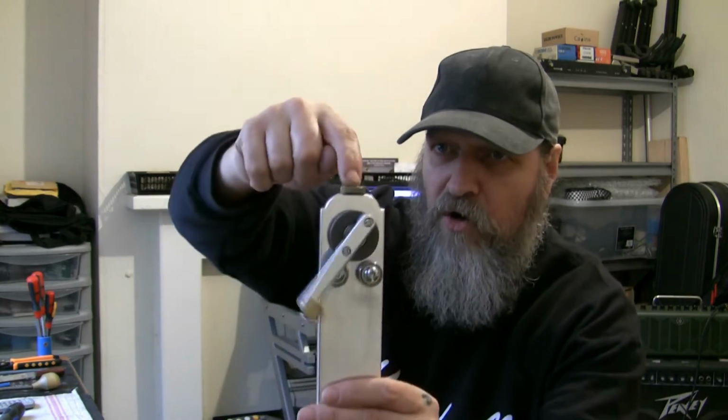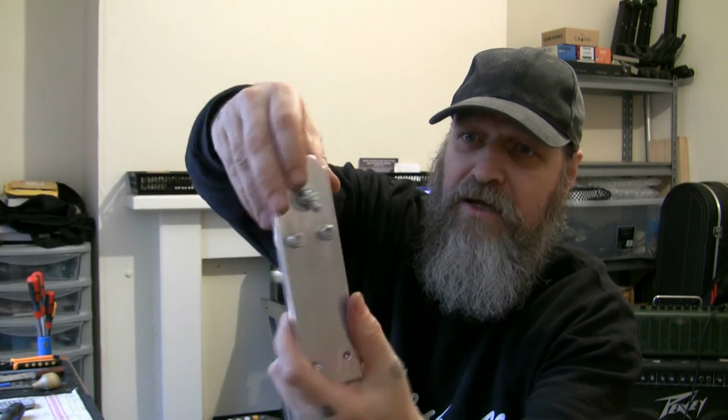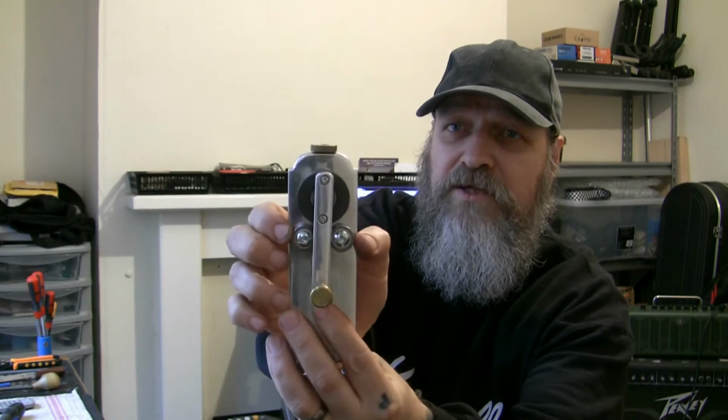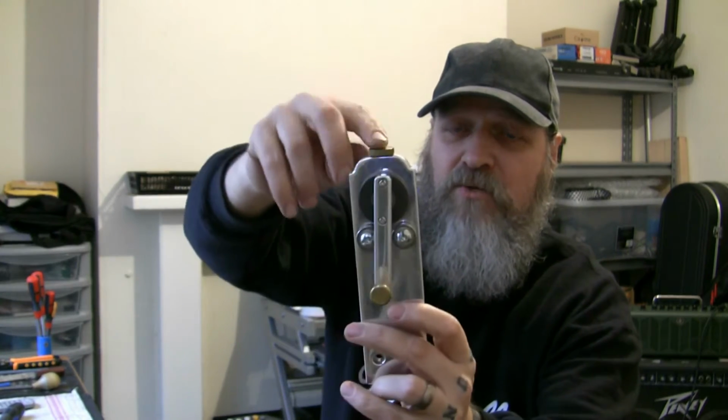But I'm going to show you how we bend the fret wire. Here we go, we've got a piece of straight. We get 4 frets per piece of this. So that's that piece here. I've got a fret bending machine here, on an adjuster, and this wheel goes up and down and it locks at the back. These two bearings either side don't move, and they spin freely. Then we move this up, down, and back until we get the radius we want.